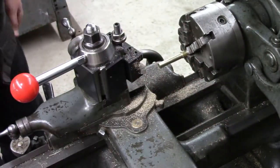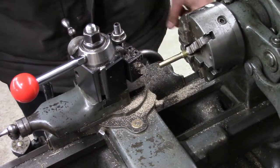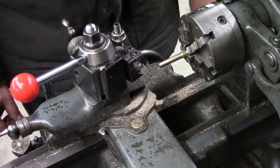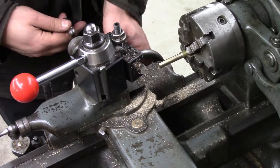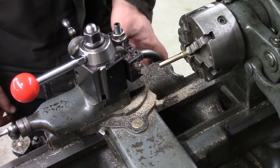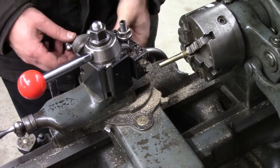312, so that's pretty good. That piece is the size. So this next piece, the diameter is critical. We've got to hit it pretty much at 249 to give it just a slip fit inside a 1/4 inch reamed hole. If it goes too far undersized, it'll leak. If it's too far oversized, then of course it won't fit.